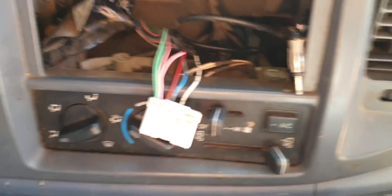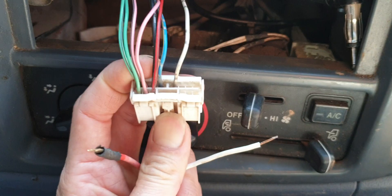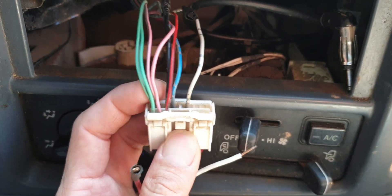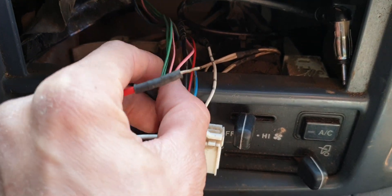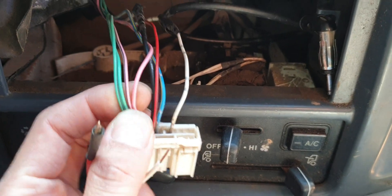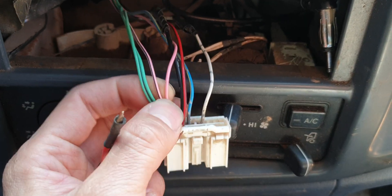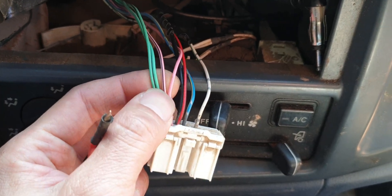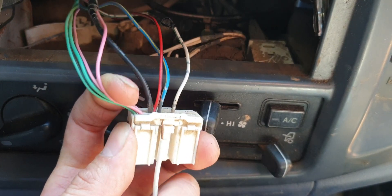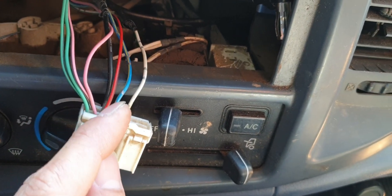In this case the truck has a port with eight wires — only eight of them — because the truck has only two speakers on the dash. We already identified that the two green wires, and the pink-red, green-red, and green-black wires on the side are for the speakers. So four of them are for the speakers.